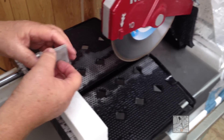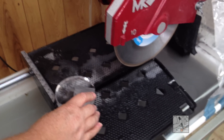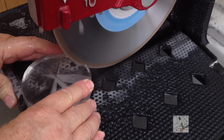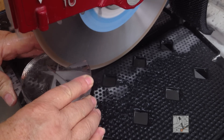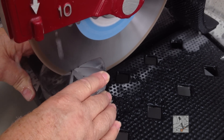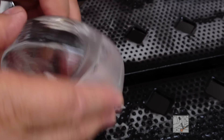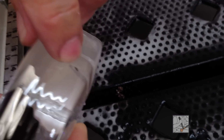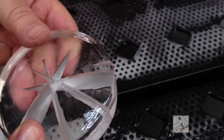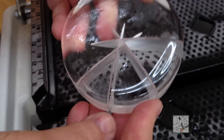You may think we're basically wasting our dressing block, but it's a tool and this is what it's designed for. I'll cut in a different place so we can see the difference. This little spot is where I started before I felt it needed to be dressed. If you look into the cut a little bit, there's a little bit of mark there from the metal that was being left. The cut itself went a little quicker after it was dressed, which it's supposed to. Again, a small amount of chipping, but still on the back there is blowout.